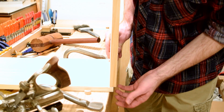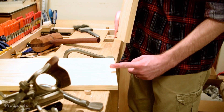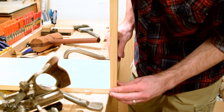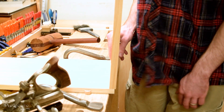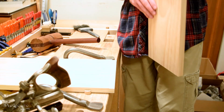You can see how this is going to be used when we go to lay out the pins. We'll cut the tails here on this board — so these will be shaped like dovetails — and then this board will go on here, and once we cut the dovetails we'll trace those out to do the pins.